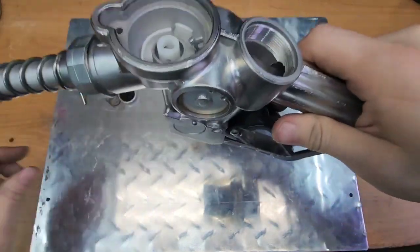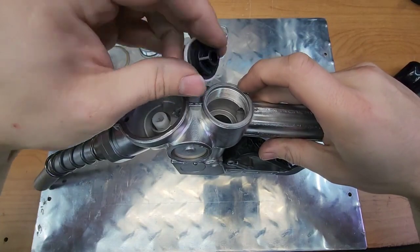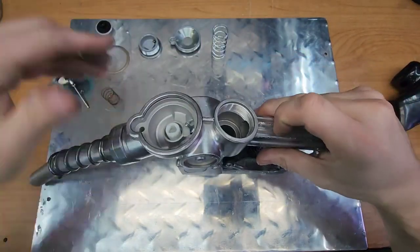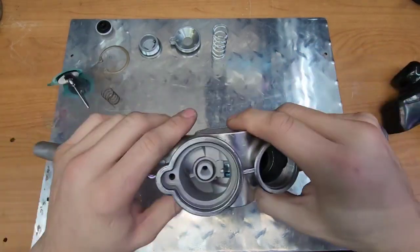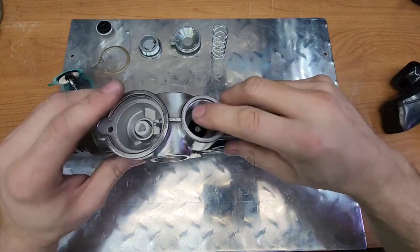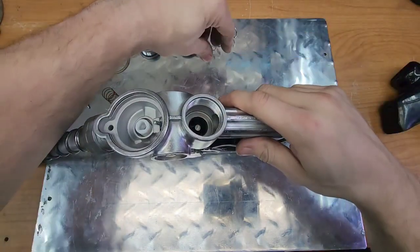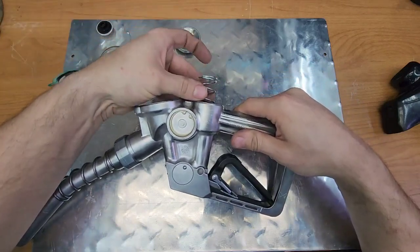It's kind of hard to do this one-handed. Normally on top of this rod here would be this rubber piston, like so, and that would sit facing down, sealing off that hole, preventing gas from the handle here going down through here and then out to the nozzle. So you squeeze on that, but you can only squeeze it once there's pressure there. So you now have pressure, that allows you to lift up on that, and there is this giant spring that lives on top of that to give you counter pressure.